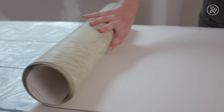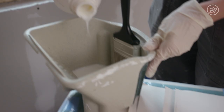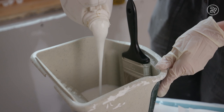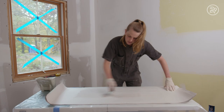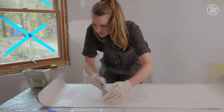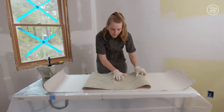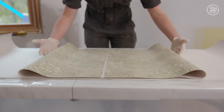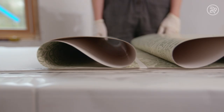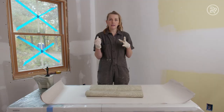I'm going to bring my wallpaper back. We've got our paste — let me just shake this up. Pasting is just like painting, but you just want a nice, even coat. Remember the whole piece. And you definitely need to get the edges, because that's where your seams come together and you want a nice, secure edge. Wallpaper is a balance of quick and delicate. So now that I've pasted my first sheet, I'm going to do something called booking. This is only something you need to do with pasted wallpaper — you're folding the paper in on itself so that the paper can saturate, the paste can become part of the paper. Some people even say that the paper expands a little bit. So I will let that sit before I apply it to the wall.